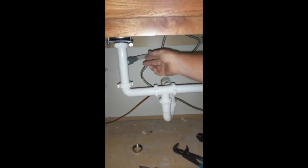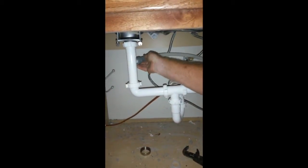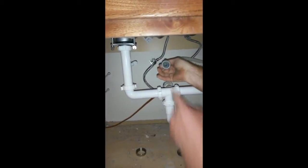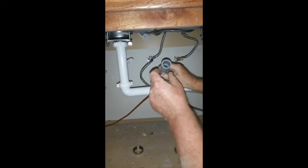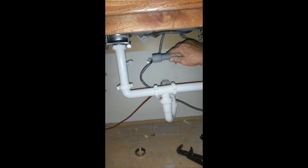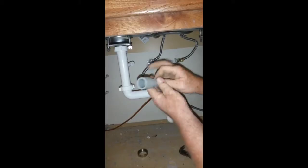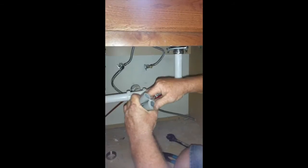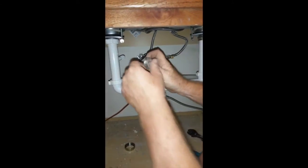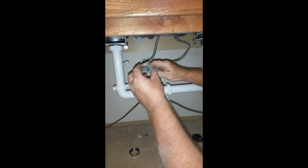Dishwasher hose, if you'll look and see that this part here, it's made for two different sizes. This is the side that would go on if it was going to hook onto a disposer, but we don't need that part, so we're going to cut that off. Okay, now we have the smaller part. This is what fits onto that. There is that right there.